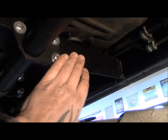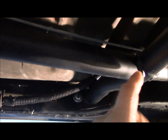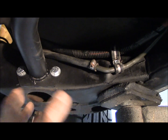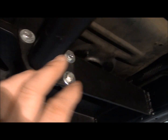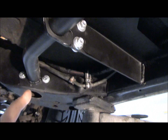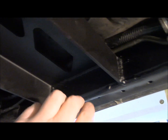So what I explained to you was it comes along with this piece of tubing. This piece of tubing has to slide through these brackets here. Now the tubing joins on back here. They've already cut it properly and notched it so it fits around this pipe. What they haven't done though is at this end they've left it a little longer, because this kit is meant for different models of cars, so it might change depending on your application. What I had to do here was slip the tubing through this bracket here. When you line this tubing up at the other end and it comes to this end and lines up, you'll know if you need to cut any off or not, because you'll see where this lines up.